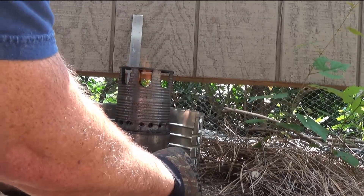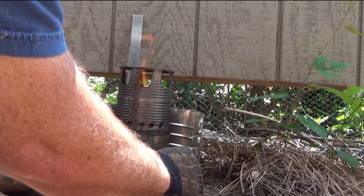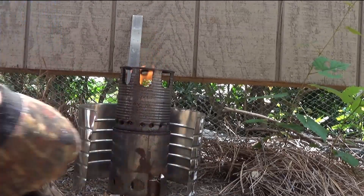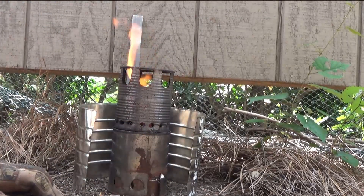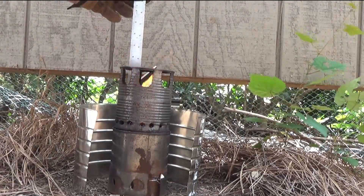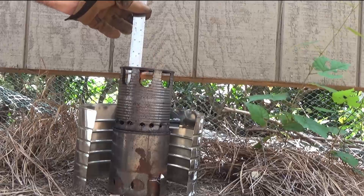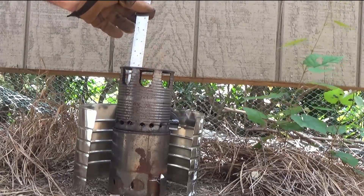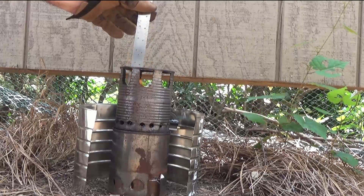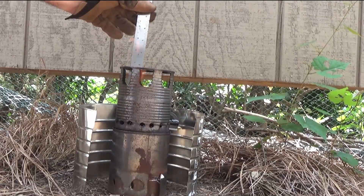You can see I'm adjusting the dampener and we're going to measure the flame height. Currently I have the dampener set at about half closed, and it takes about a minute for the flame to fully calm back down. With it set at about half closed, you can see the height of the flame is about one to one and a half inches.